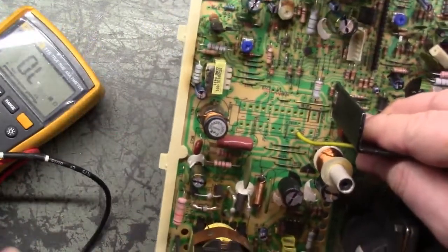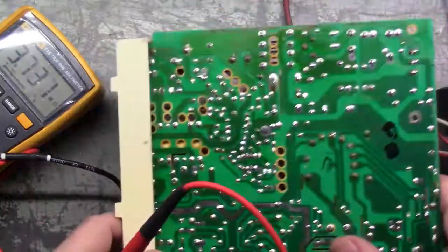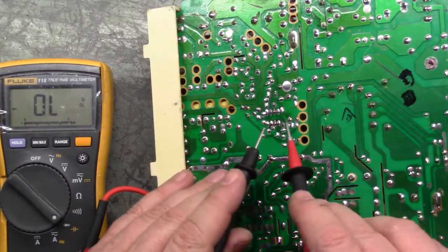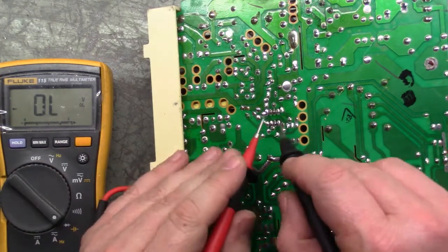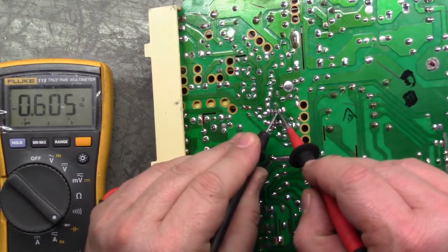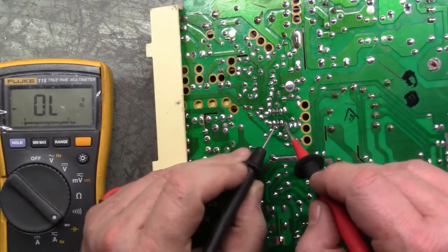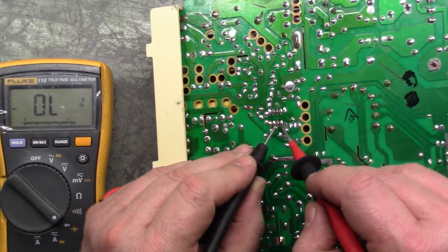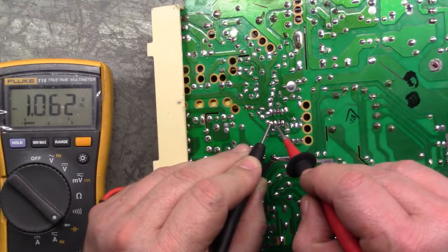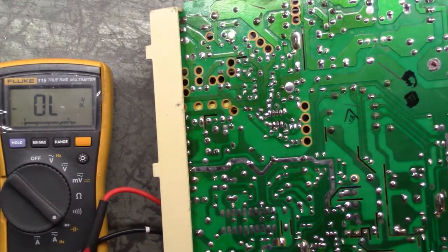Let's do our switch mode power supply chip. You want to have the power supply section facing away from you. Go to diode checker and test these two pads - it should read like a diode. Negative on the left side, 0.6 - that's good. This should read the same thing. This one should be around 1.7 - yeah, 1.7, that's good. And this should be 1 point something - yeah. Those are the readings you should get around that chip. Not shorted, so I'm betting our power supply is good.